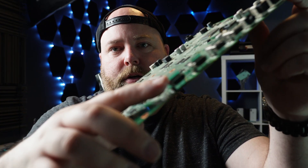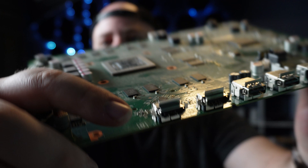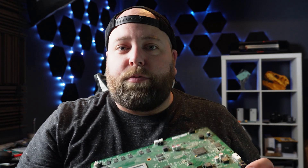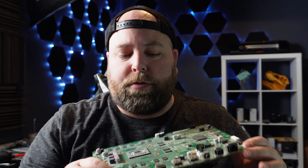In the end, what you're looking for is plenty of solder going through the legs, each one of the pins having plenty of solder running up to it without bridging. When we flip it over and look at the back side, one doesn't have a leg that comes all the way through, but the other three do, and you can see there's plenty of solder. There we have our new HDMI all installed, looking really clean and really good — all of the pins making solid contact without any bridging. Hopefully that helps you understand some of the basics for micro soldering.